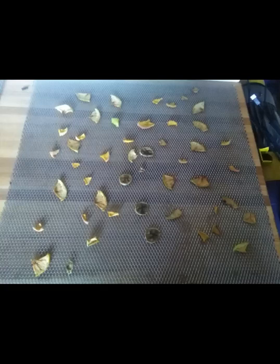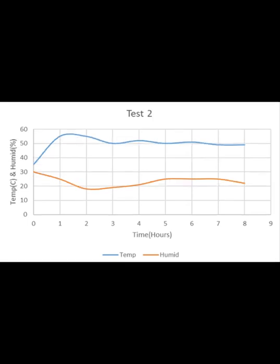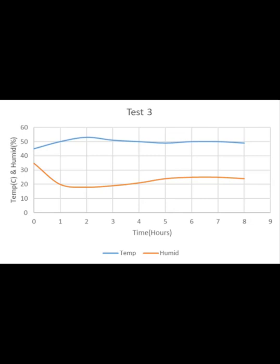The results can be seen in the following pictures where the fruits have been dehydrated — you can clearly see that the fruit is dehydrated. The following graphs indicate the level at which the system performs. The heating element was heated up to a temperature of 75 degrees, and at one test it reached up to 85 degrees, but the average temperature throughout the system remained around 50 degrees, which is sufficient to dehydrate fruits.